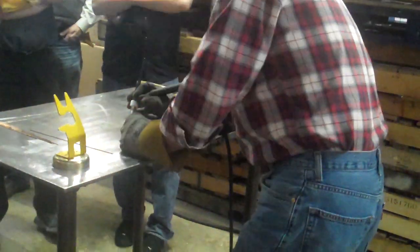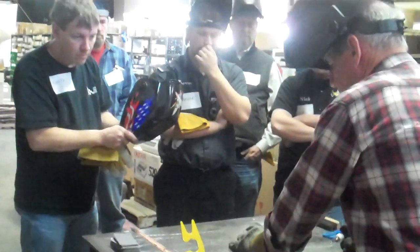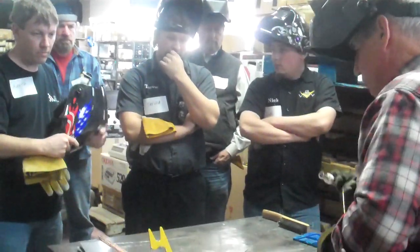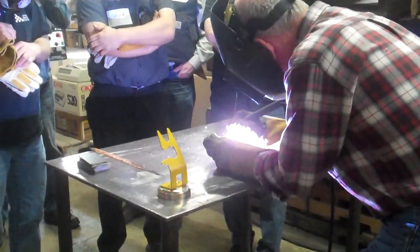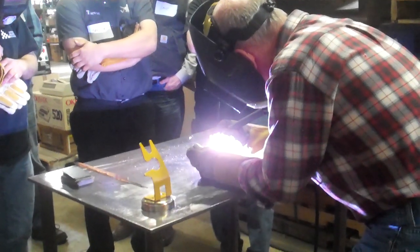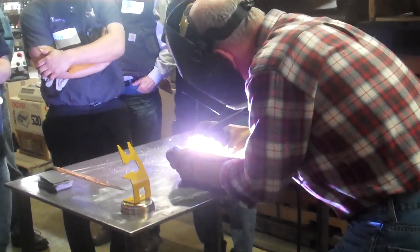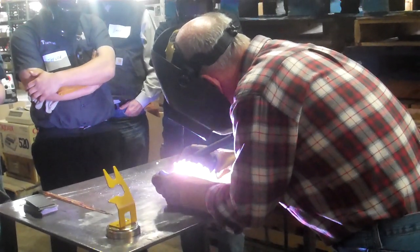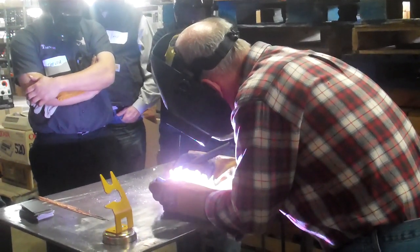Keep the same height above the work piece — that could use a little more heat there, but that's basically what you want to do. So once you get comfortable with moving the torch along, the next thing you're going to do — put your helmets on. You're going to strike an arc, slowly increase the amperage, and then you can see the molten puddle. From there, you're just going to add the welding rod to the leading edge. Try to keep a steady flow across the work piece of the base metal.